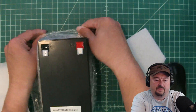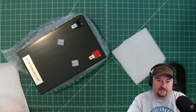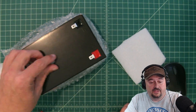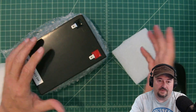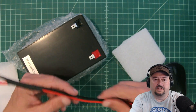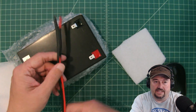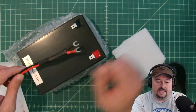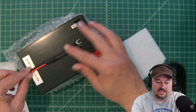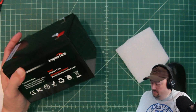When we take a look at this battery it has these terminals on here, and I believe they're called F2 terminals. We want to be careful with these because we don't want to drop something on here and bridge them, short them, and cause all kinds of problems. What we're going to do today is make a cable that has power poles on one end and the appropriate connectors on the other end, so we can just connect here and then charge or use our battery however we want.